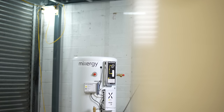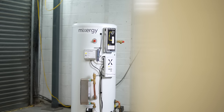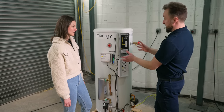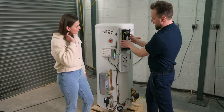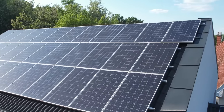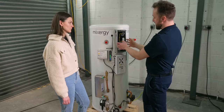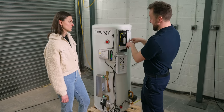There are a lot of boxes on the front because it's catering to every conceivable setup for demonstration purposes — you might only have one or two depending on what you have. Here we have a solar diverter: if someone has solar panels on the roof, this system will measure any export electricity at the fuse board and ensure that instead of leaving the house, it's turned into free hot water.